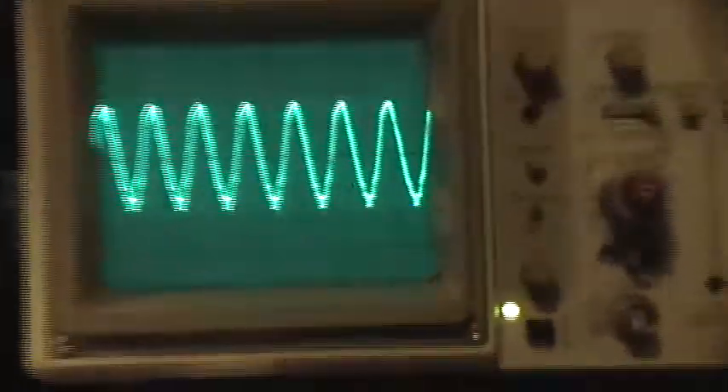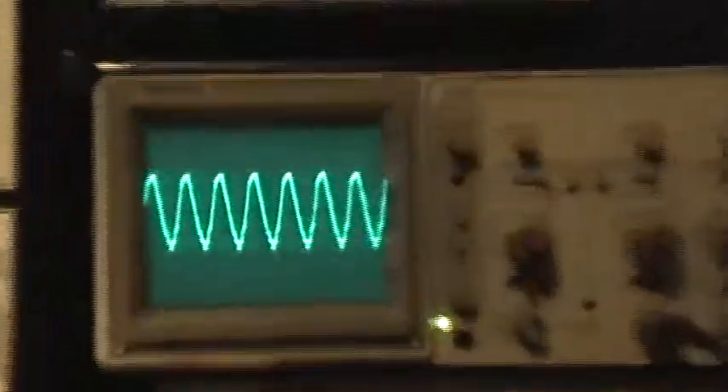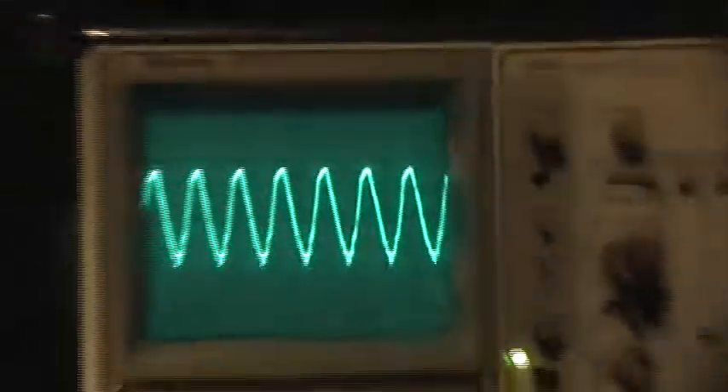And the waveform now. The waveform is being picked up by an oscilloscope probe connected to this peanut can up there, and that's what's picking up the waveform. We're looking at that at 50 volts per division on channel 2, so we've got about 150 to 200 volts at the location of the peanut can, picking up the field from that coil. It's very close to being a good sine wave, and what that means is the coil is working exceptionally well right now — it's switching in a true Class E mode, which is pretty efficient.